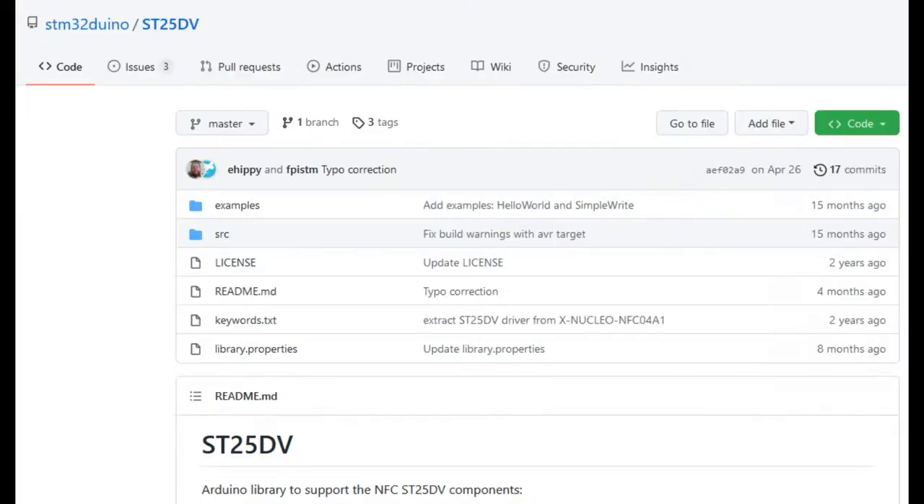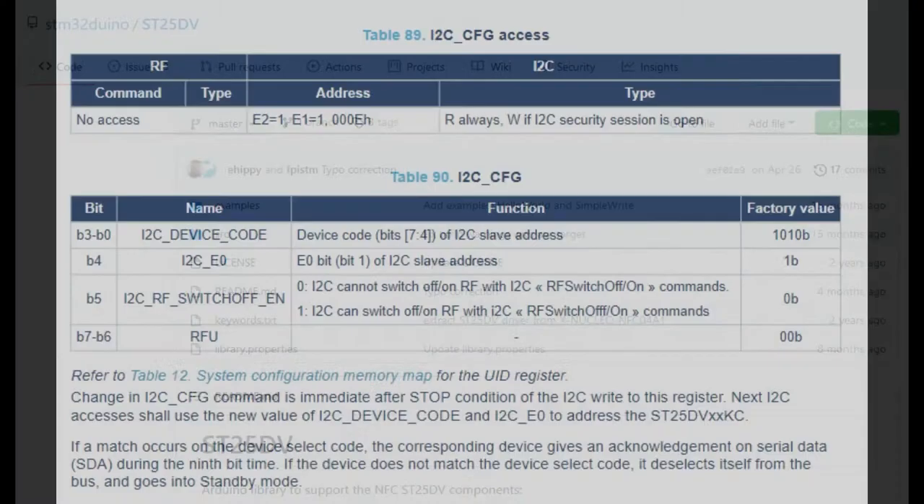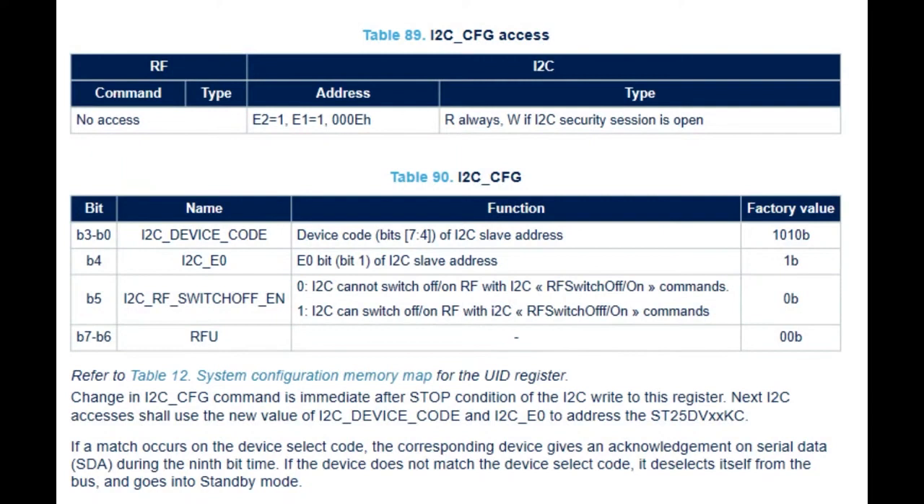There is a library for the ST25DV on the I2C side. From the NFC side, you just use it according to any API you've got for iOS or Android — it acts as a normal tag. The mobile device does not know the difference between it and any other ISO 15693 tag. There's also the K and KC version; the big difference is you can change the I2C address of the KC family. Otherwise, they're pin-to-pin compatible and functionally very similar, so you can pretty much use either.